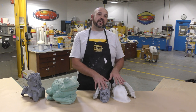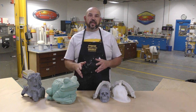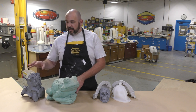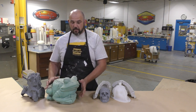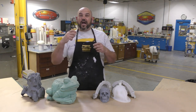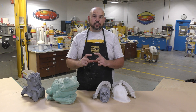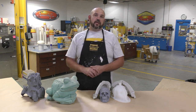Now, I wouldn't use a cavity pour mold over difficult models that have a lot of limbs sticking out, but more models that are unified in shape and lend themselves much easier for a unified mold that you can easily pull over the model. Now, small models just don't make sense to make cavity pour molds off because they're so tiny that a block mold would be just easier.